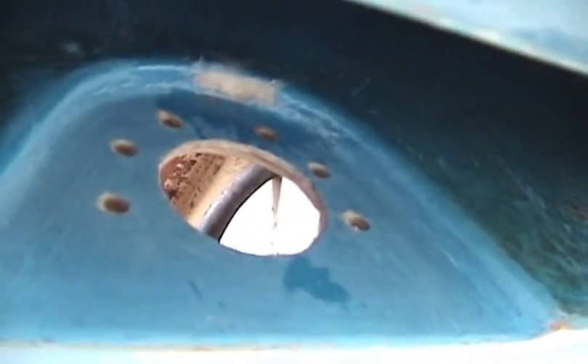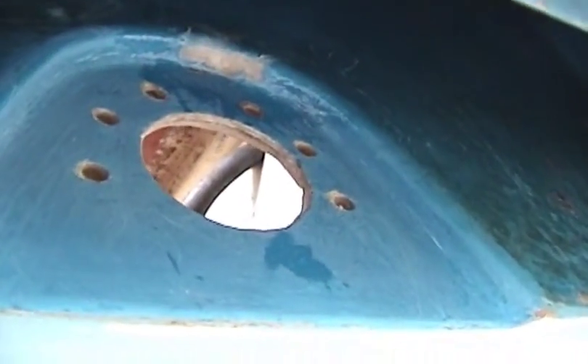Here is the keel trunk facing forward on the boat. There's where your keel pin brackets mount. That's where it was rubbing — the keel was rubbing when it goes up and down with that side pressure. I epoxied all of that now. The front of the keel trunk had a big crack in there and had been patched evidently. They might have let the cable snap once, or had it down and it crushed that.